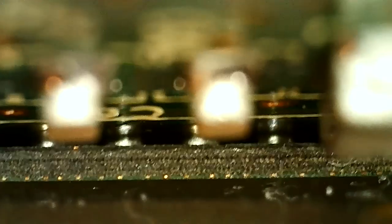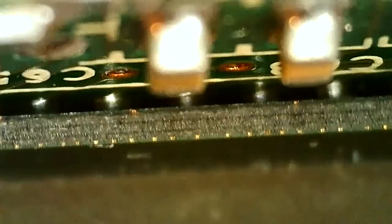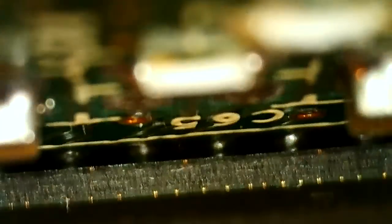It looks good to the naked eye. It's also hard to judge now that I've cleaned everything. Everything is almost mirror finished, so clean compared to the rest of the card. But anyway, when I looked at the card at first glance, I had some balls that looked huge, like two balls that had melted together. But if you clean it, so I used some electronic cleaner to spray around the chip.